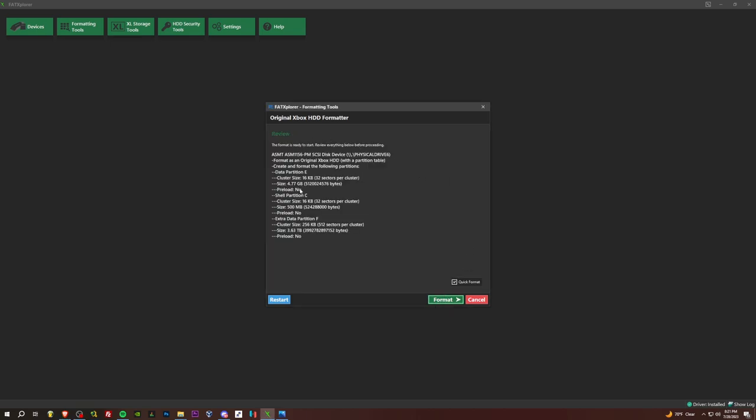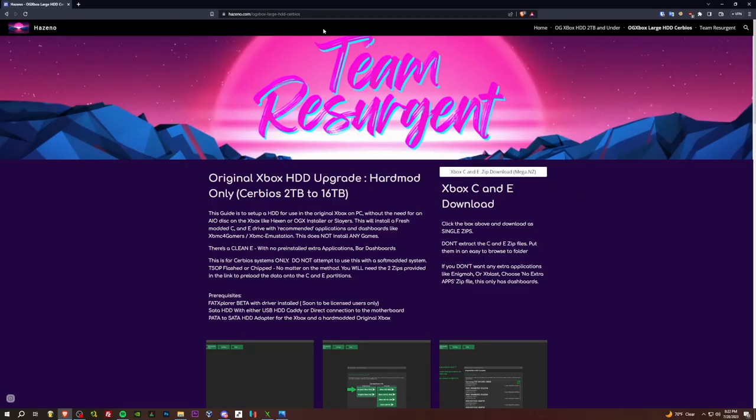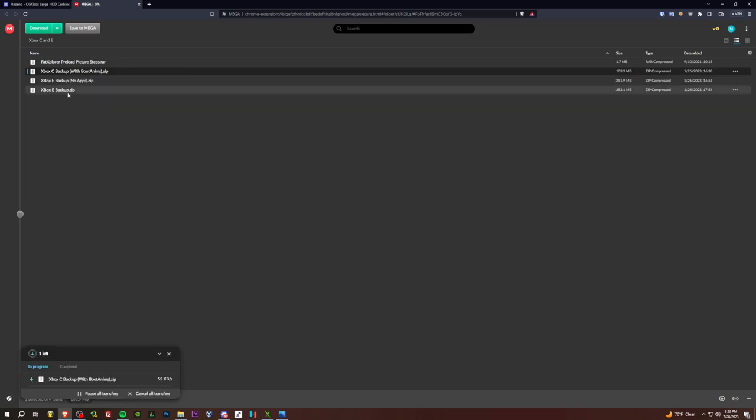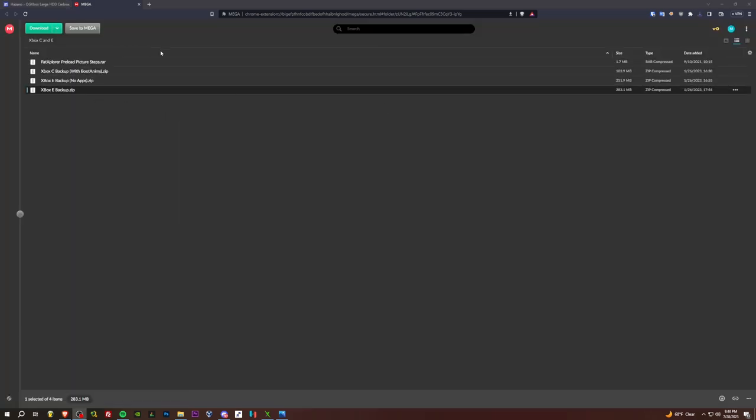Go next. And here's where we format it. Now, mine's already formatted, so I'm not going to do that, but yours is fresh, so go ahead and do it. So now, we've got a formatted drive, and what we want to do, so we come on over here, and it has a C and E drive, and what we do is we grab Xbox C and E from this mega link here. We got the C backup with boot animations, Xbox E. So we'll download the C backup, and we're going to go ahead and download the E backup that has apps preloaded to it. All right, ladies and gentlemen, I have downloaded the E and C drive backups.